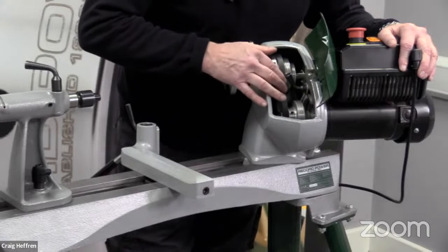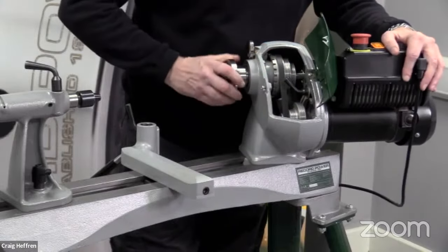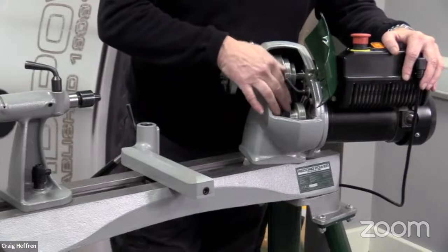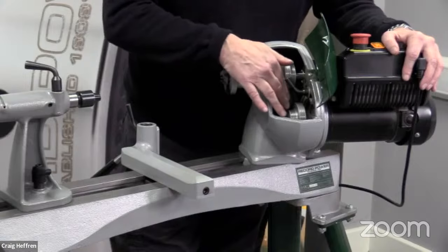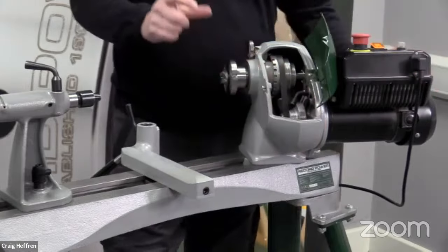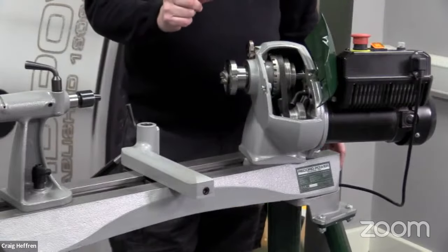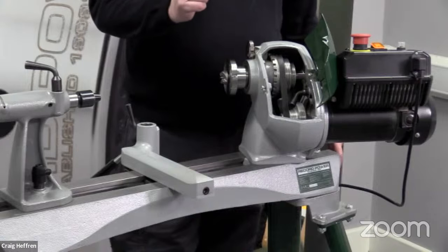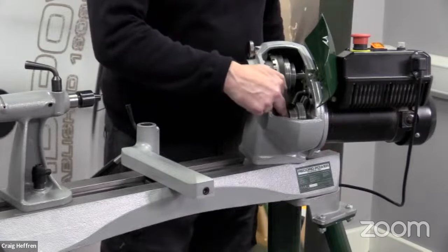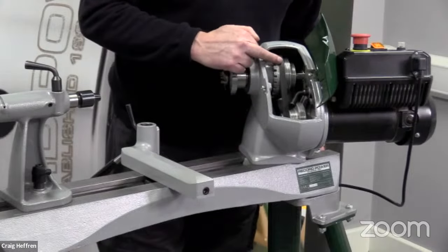The thing about it, this is a poly V drive belt. So it's a drive belt with a multitude of Vs on. Because before, when things started, you used to have V belts and then you had flat belts. And this is a better combination of both because you've got the width of the belt, which is giving you the actual reduction in vibration. And then you've got the Vs, which is giving you the grip as well. So you just make sure they're lined up correctly in the corresponding Vs on the pulley.